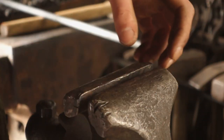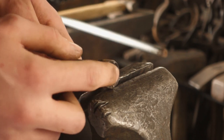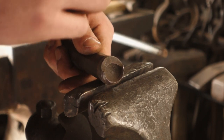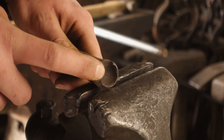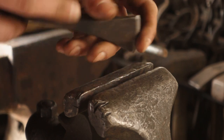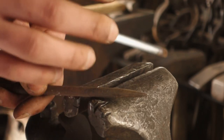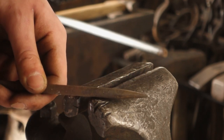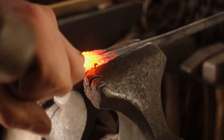That's to do after we forge the head. This tool is basically just a really big eye tool with a section cut out, and this is for the eyebrows — I do a double eyebrow on the dragon's or serpent's head, and it's got quite a steep bevel on the outside. Then a simple curved chisel to split the horns. The final tool is this really fine pointed center punch, which I use for the pupils — it's a really narrow end so we can get in there under the eyes and dot the pupils. So let's come on and get the nostrils set first.